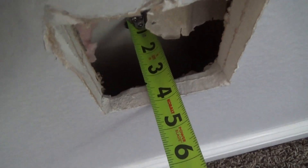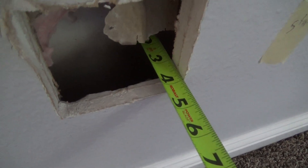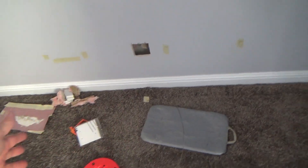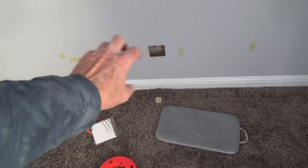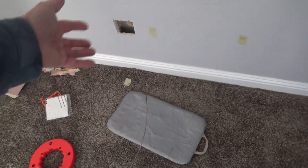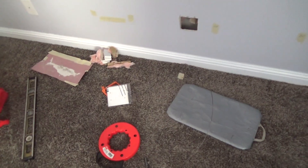This wall is only three inches wide — can you believe that? Most walls are three and a half inches. I cut the sheetrock back a little on the back side to reach my hand in, and you can see it right there — three inches. Because the studs go full height inside this wall, they put fire blocks in, which also give a place to nail the baseboards and a solid area for carpet stretchers.